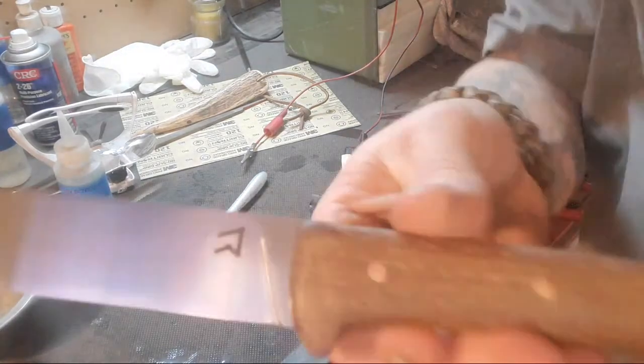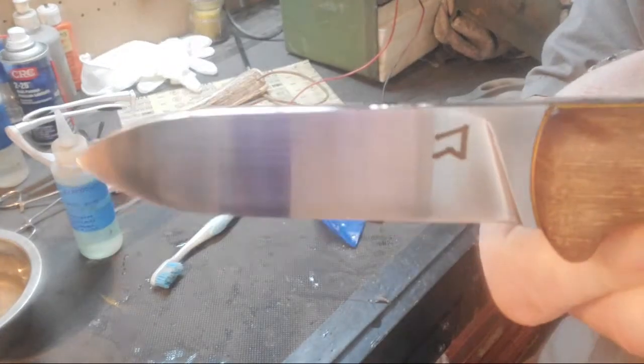I can see where it transferred all that metal, so I'm going to go to the other side for the mark. Because I'm holding the knife blade, if I touch the wet pad with my finger I can feel a little electric shock — kind of like putting your tongue on a nine-volt battery — because I'm basically completing the circuit. Before I'm done, I want to peel this back before removing the tape and see what I have. It looks like a really good mark. There's some solution on there so I'll get that cleaned off really fast so it doesn't discolor the blade — just clean water. And there we go — we just made that stencil and etched it onto a knife, nice and clean.